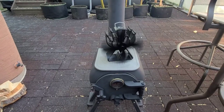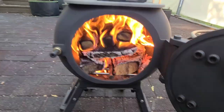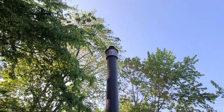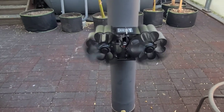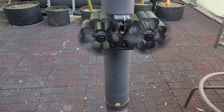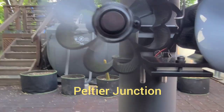About three minutes into the fire — the top fan started at about one minute and is cruising along pretty good. The flue pipe fans haven't started yet, but we'll wait. About four minutes in and these fans are zinging along pretty good — they just started. As I recall from last year, they took a little while longer because the heat has to travel through the mount to get to the little thermoelectric element at the end that produces electricity from the heat.